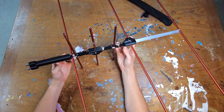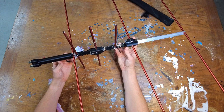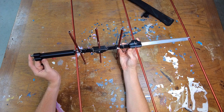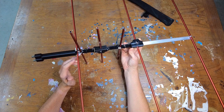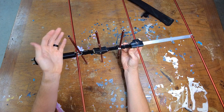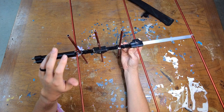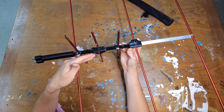Let me take a look at my 2-meter/70-centimeter Yagi antenna. They are set up on two different BNCs, so you could work satellites with this if you wanted. I mostly just use the 2-meter portion and don't even attach the 70-centimeter elements, because the 2-meter portion seems to tune up on 70-centimeter pretty well also, so I can just avoid putting these on — but if you want to do both, it's a possibility.